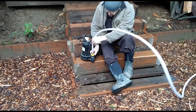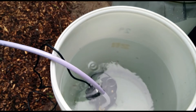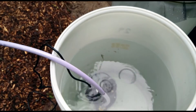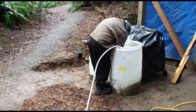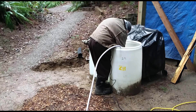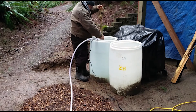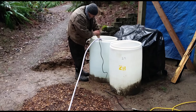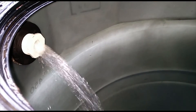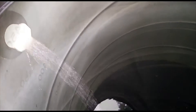Other times I'll just go straight to the river and fill the tank up to the 500 gallon mark. This Ever-Built one horsepower sump pump that we're using empties these 50 gallon barrels pretty fast. We also use that sump pump down in the river to pump up to our 500 gallon tank.